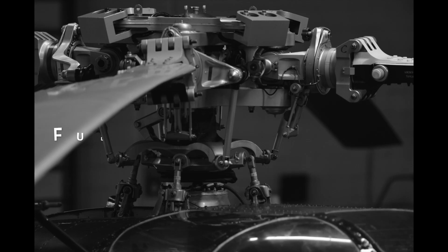So now that we know we need to free the rotor blades to flap and lead or lag, how exactly do we do that? There are three main solutions, and thus three main categories of rotor systems: fully articulated, semi-rigid, and fully rigid.